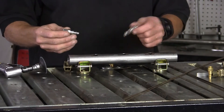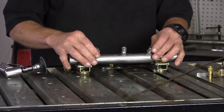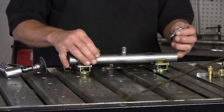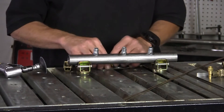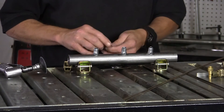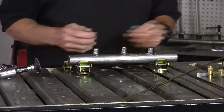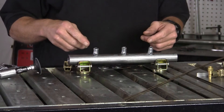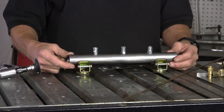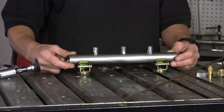I've got the pipe cut and the holes cut. Now I'm going to put the fittings on. I'm going to use silicon bronze for the steel fitting. When you drill these holes, make sure all the chips and everything are cleaned out, because those chips will get stuck in your line and cause problems down the road. On one end I'm using an air fitting with a flat washer so you can connect it, and on the other end I've plugged it with a flat washer too. After it's welded up we'll put some pressure to it and soap-check it for leaks. I'm also going to put some brackets on the ends so I can mount it on the wall or a column.